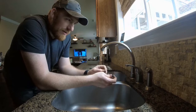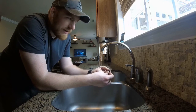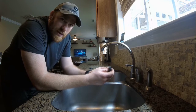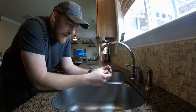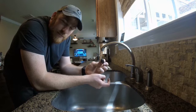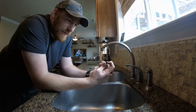The aftermarket parts had a very bad feel in the lever. When you started turning the water on, it was so tight it felt like you were going to break something, and it didn't even fix the leak. So I switched to Delta official replacement parts, but I was in a hurry and jumped to conclusions — all I replaced was this plastic disc. I didn't replace the spring-loaded seals on the bottom of the faucet; I didn't think to keep looking.